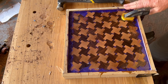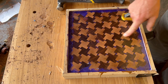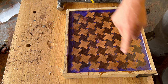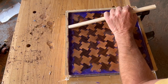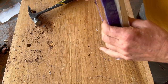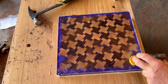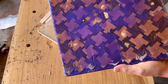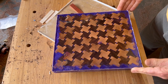Our epoxy has had seven hours to dry and it looks pretty good, although I'm going to have to come back in and fill a couple of the holes which sunk or had bubbles pop in them. These little bubbles I'm not worried about because I have to sand all this flat anyway. I pulled out the screws all the way around — let's see if we can get the frame to come loose. When taking the bottom off I like to use wooden wedges; they work very well. The bottom is all going to get planed off anyways, so it's not an issue. Now I need to just sand and put it on the table saw and cut it square.